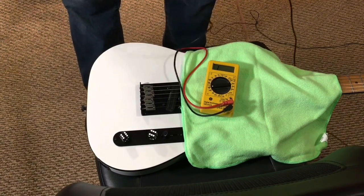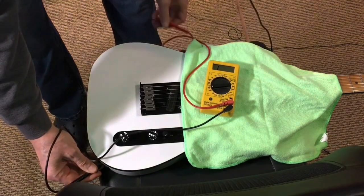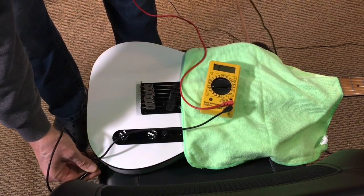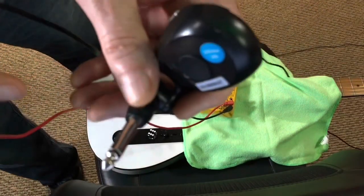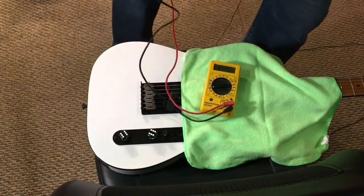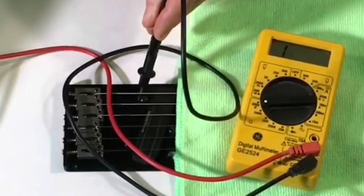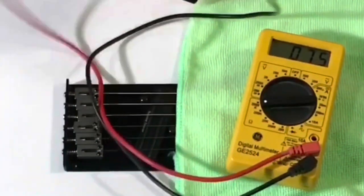could get some conduction. Now, if I conduct on the common side of the jack, which would be where the sleeve part of your guitar plug would go, that is this part right in here, that's going to be the ground side. Okay, so if I touch here and if I touch the bridge, nothing, because it's not conductive. But if I touch the saddles now, it conducts.